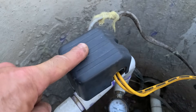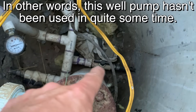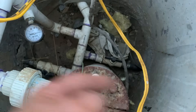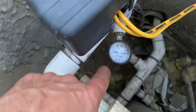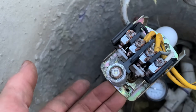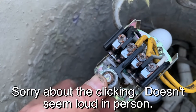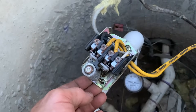I had the circuit breaker off for quite a while and I turned it back on and decided to open this up and see what it was doing. This line goes to our house and I'm in the process of doing some irrigation, so it was constantly pulling water off — thankfully. This thing was sitting at a constant 65 PSI, which is really higher than it should be; it should be like 30 to 50. When I pull up on this rail, that simulates pressure in the pipe, and I assume since this thing wasn't used for a while that whatever mechanism is in there must be stuck. So I'm going to take this out, bring it into the shop and have a look at it.